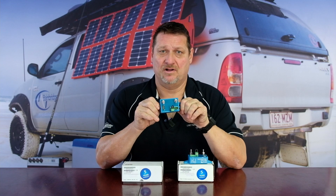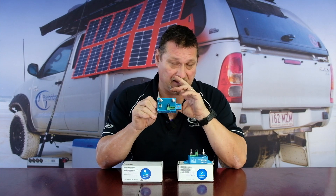So it's a great thing to have, especially if you want peace of mind knowing that your devices are going to be protected. This one is a manually set up device — there's a little plug that comes with this unit, you connect it to ground and keep touching it to ground, and this counter will count down from eight through to zero. Every one of those different numbers correlates to a different voltage that it cuts out and cuts back in at.